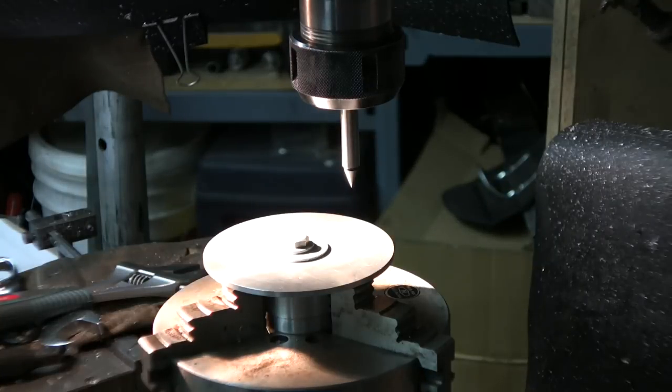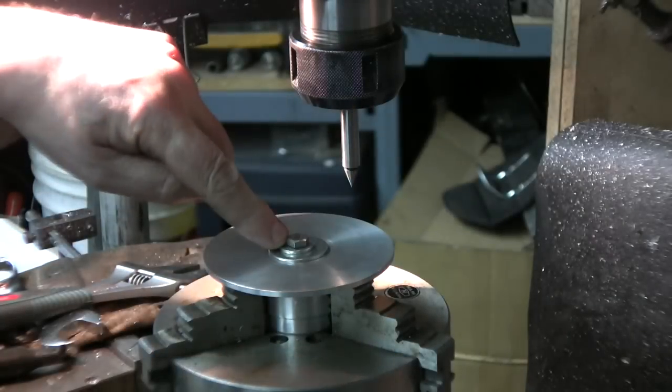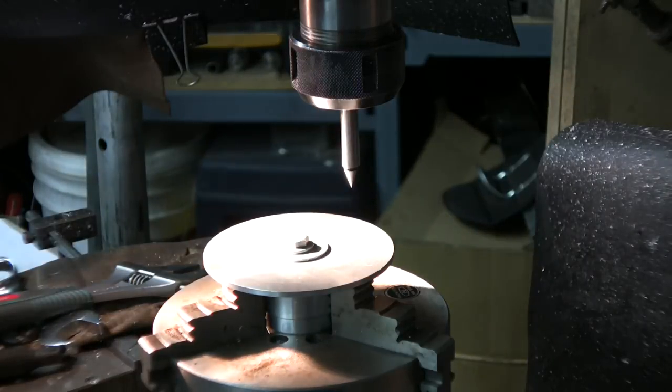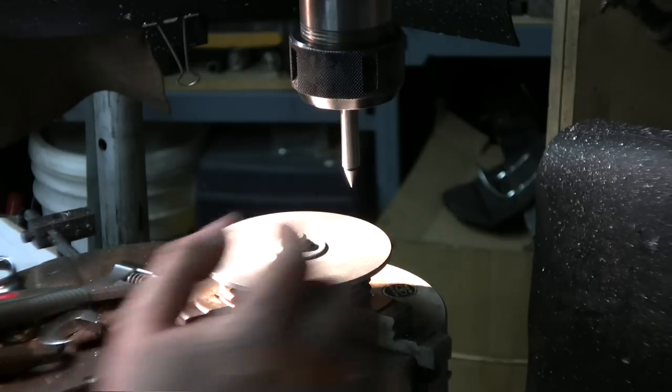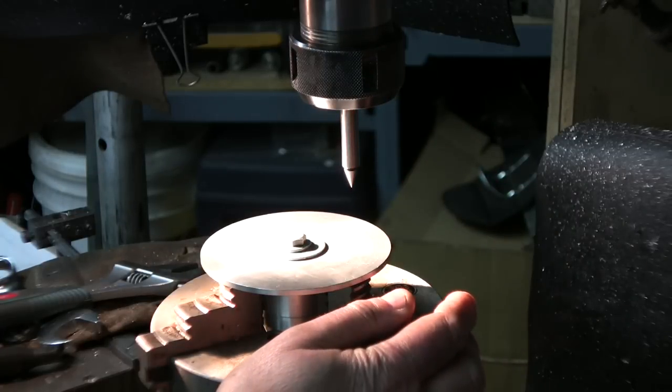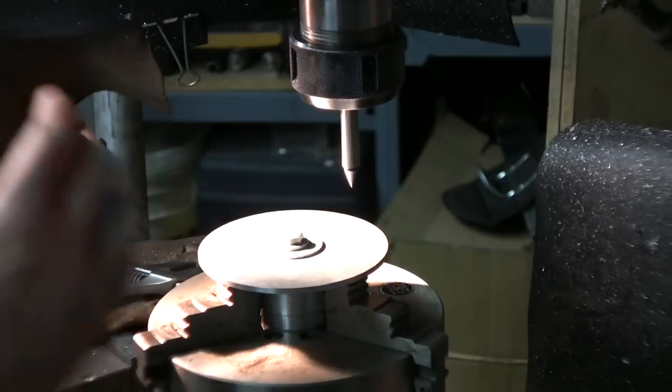Okay, best method I found to line this perpendicular. I know the slot in the middle is 594 thousandths. So if I divide 594 by 2, it's 297. If I move my table from one side to 297, I know I'm gonna have to just line up the end of the line there, and I'm gonna be right on the perpendicular. All I have to do then is come back after.